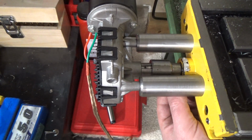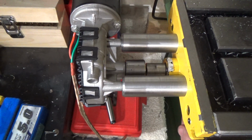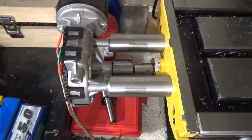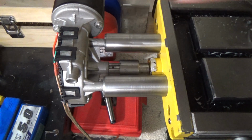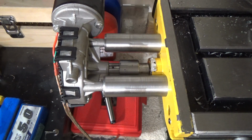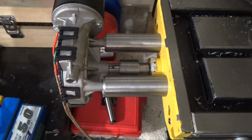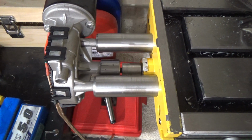The little dog still lets me turn the handle on the other side. Then when needed, line it up and drag it back in position. So that's a win. There's still a little bit of play, but I'm not going to get much out of that without going ball screw, full CNC control. But like I say, I want to keep this one a manual mill, and just have the occasional long sweep if needed.